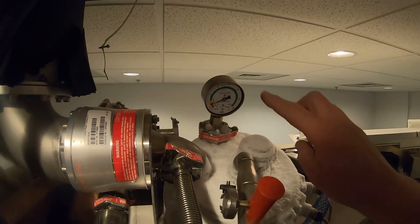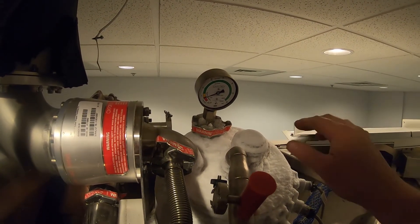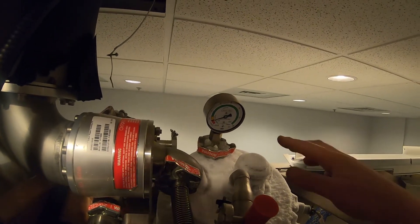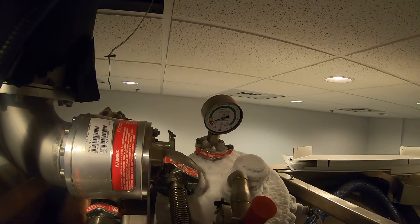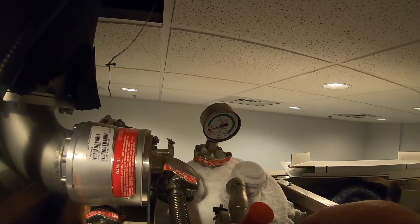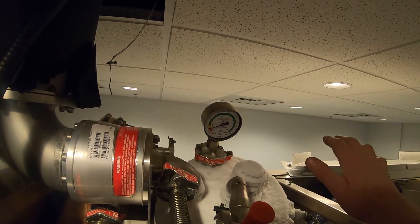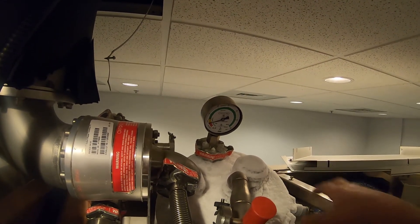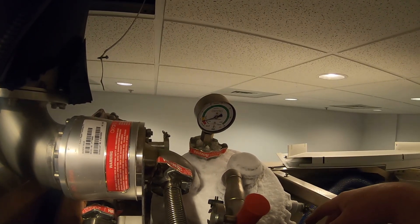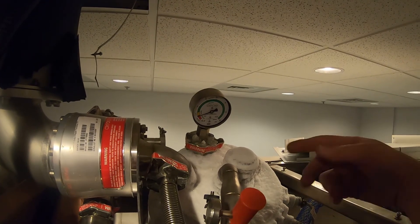We got it all put back together. I did zero out the gauge — it did go into vacuum, which happens as the gas inside the vessel is so cold the cold head starts to recondense it. I pushed the quench button again to get the pressure back up into the yellow, but as you can see the cold head has brought it back down to zero. It's sealed up and not venting anymore. I'll leave it as is and have the customer check tomorrow that the pressure is in the yellow. And that's how you change a quench pipe or quench burst disc.